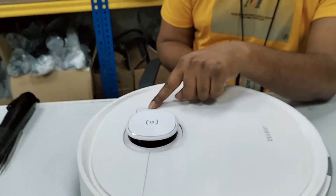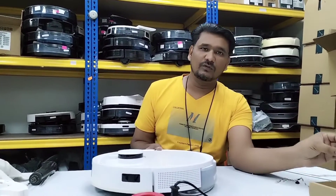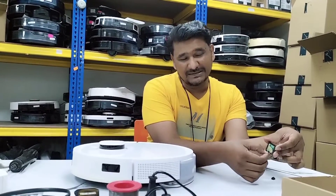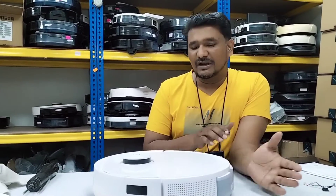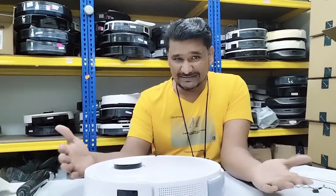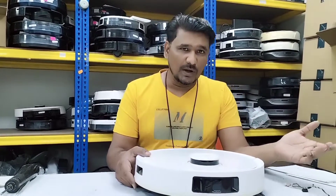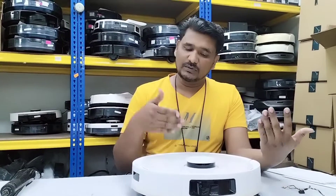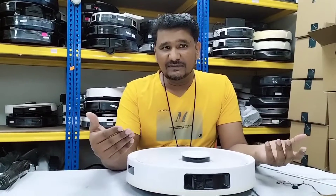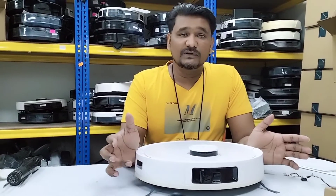The wire was broken from the connector — that is why the Osmo Pro tank was not functioning. When the tank was attached, it was giving the 'Osmo Pro tank installed' message because one wire was still connected, allowing it to catch the signal. But it gave an error and would not function because the other wire was broken. We replaced the connector and now it is fixed. That is the difference between the white light and the blue light, and when each will appear — everything explained in this video. Thanks for watching.